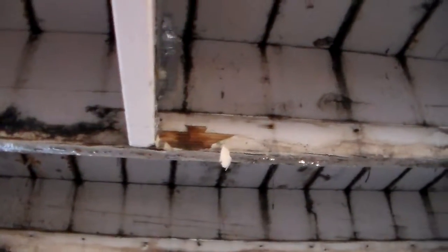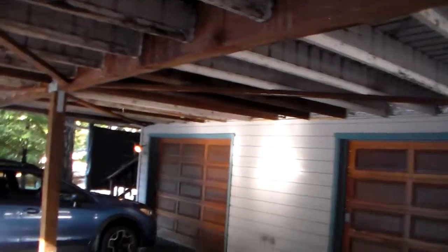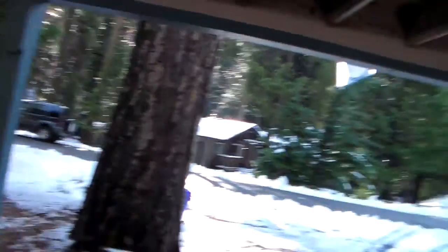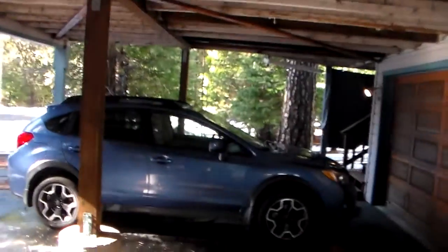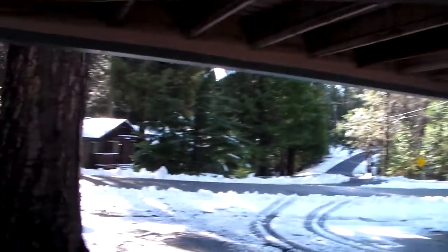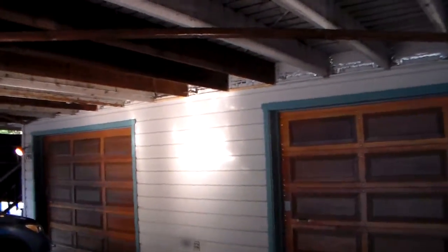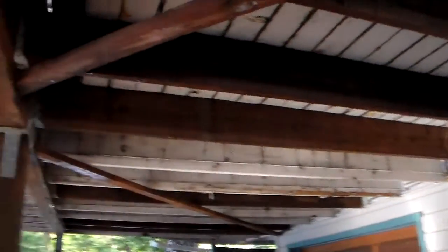You can tell it started to get to the boards underneath here. We pressure wash the entire house, then prime where it needs to be primed — bare wood areas like that — and then come in and paint with a new color. Here's my idea, you can take it or leave it — it's going to be the same cost either way. You've got a couple of posts that aren't painted, and those could also go into the trim color if that's what you wanted.